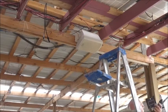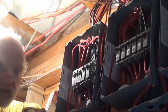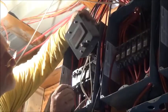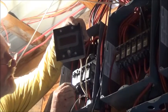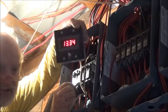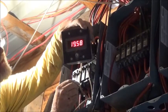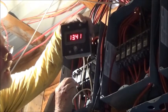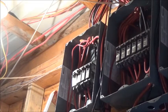When I finally finish this project, we'll straighten all these wires up that are hanging a little bit — they'll still look like spaghetti when you look up in there, but they won't be hanging down in your face. We're ready to go inside and test to be sure we have voltage and that the fuse works. We're going to make sure the fuse and the circuit works and the circuit is complete. Now I'm reading 13.34 — that's the voltage connecting to the main bus bar but not going through the inverters and the batteries. It's actually 12.83 looking at the meter down there. With the circuit off, we get 19.58 up here, and when I flip it on it should drop to the 13s — and it reads 13.32. We've completed the installation. It's safe. If something goes over 15 amps, it'll break.